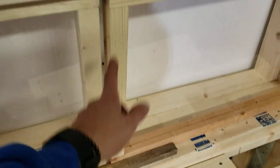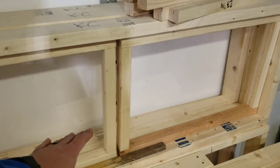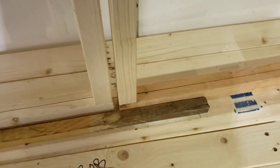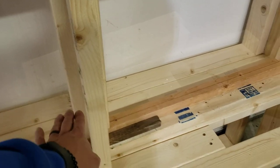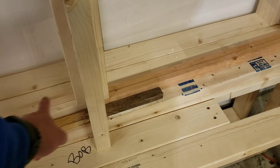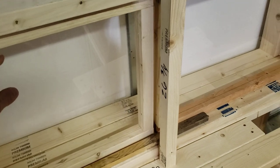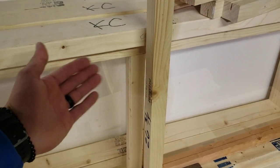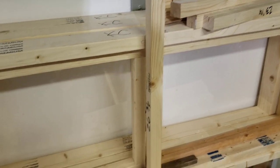I did plan on running a board up the middle here. I'm going to recess this on the bottom and run one straight 2x4 all the way up — it helps keep the whole thing true and square and will close this gap from the elements. Also, if I have a 2x4 running straight up here, I thought about cutting out notches or having a nail sticking straight out. That way, if you're in the middle of your stand, you can rest your gun on the nail at various heights. You could have three, four, or five nails to help balance your gun depending on the angle of your shot and your terrain — or do a fancy cutout, but you've got to leave enough room for your sights and optics.